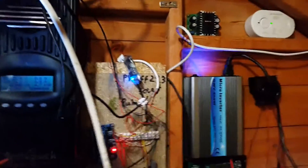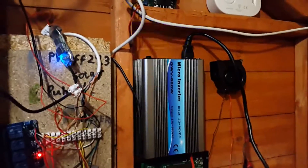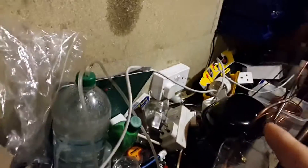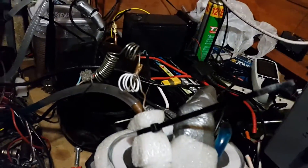Recently I've noticed a rather problematic safety issue with this grid-tie inverter. If you switch off the plug, or if the power is switched off in the house while there are still other loads connected, it still powers them — it doesn't switch off properly. It does switch off fine if you just unplug it completely, but that's not always the scenario.